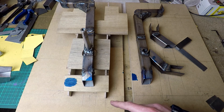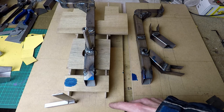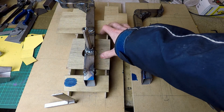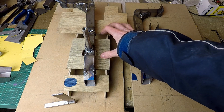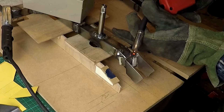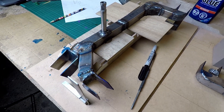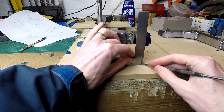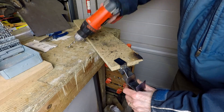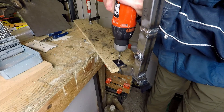When all the bits are welded on, what I'll be able to do is use a square like this so that the axles for the rod end bearings are in exactly the right position, both horizontally and vertically. Just to emphasise that I've only used this jig for tack welding — obviously as it's made of plywood it's flammable, so if I tried to do full welds on this the whole lot would go up in smoke pretty quickly. Here I'm tack welding the end flange on. I've used little high power magnets to hold it in place. The steering bracket has now been welded on. I'm marking out the position of the rod end bearing axles and drilling through the axle holes using a hand drill. The surplus metal on those brackets will be cut and filed away.